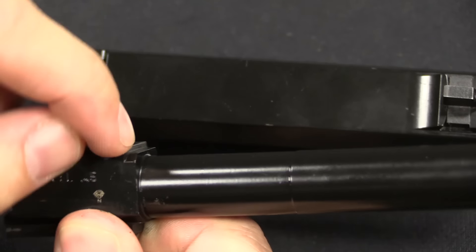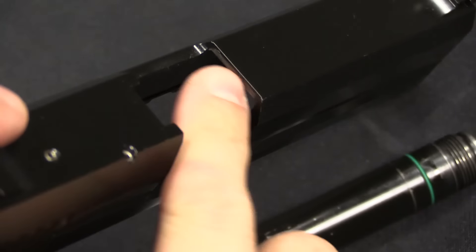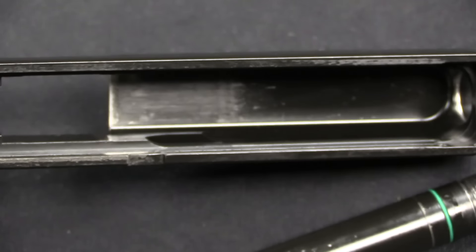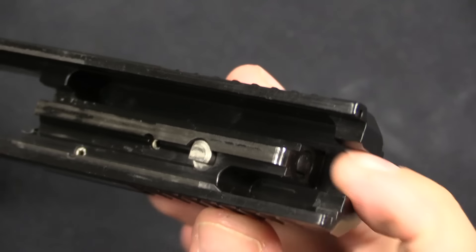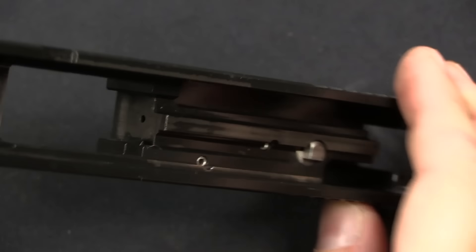You can see there is no separate barrel bushing at the front — that O-ring just sits right there inside the front portion of the slide when the gun's locked up and in battery. It's a very simple mechanical principle that will very effectively centre the barrel precisely for each shot. The locking surface is right here on the front of the chamber, locking into the back of the slide surface — so no need to cut locking lugs in this area like a 1911.